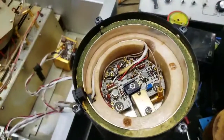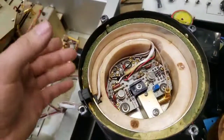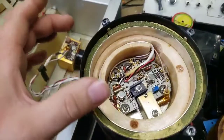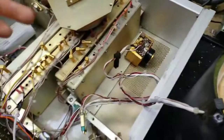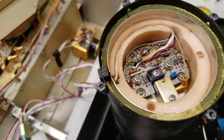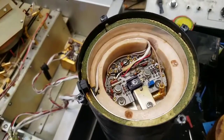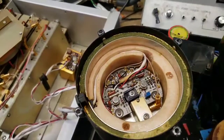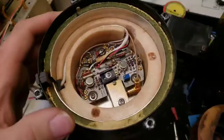That standing wave only occurs at a very specific frequency, which is what the system is looking for. It's a closed-loop servo system that adjusts the lamp and the feedback to lock into exactly what the atomic structure wants to do at that exact frequency. That then drives a crystal oscillator which outputs your frequency lock, giving you very high accuracy — I did the math and I think it's an uncertainty of one second over 100 million years. A cesium clock, which they use on everything now, is about plus or minus one second in 300 million years, so these are very accurate systems.